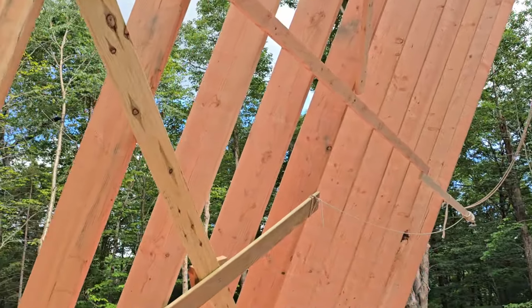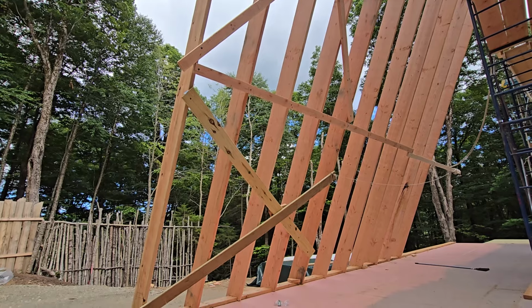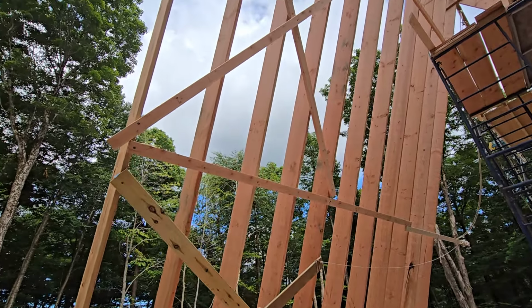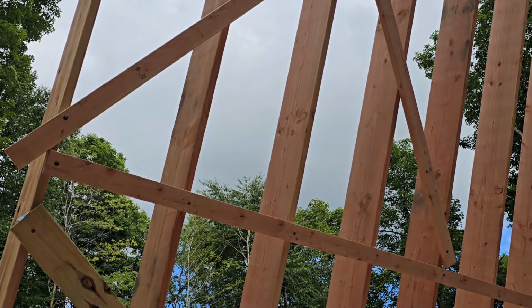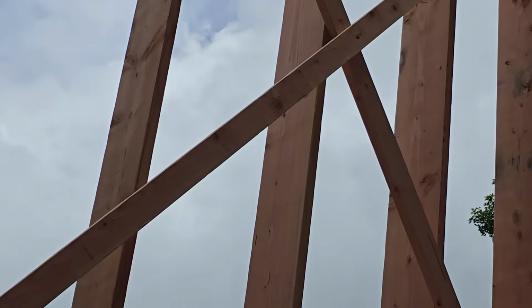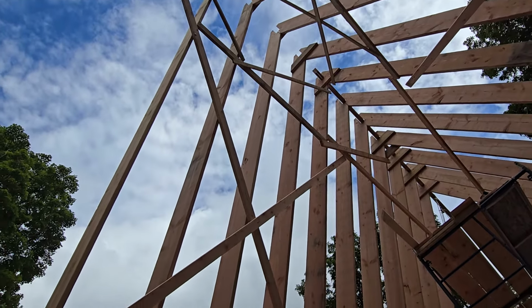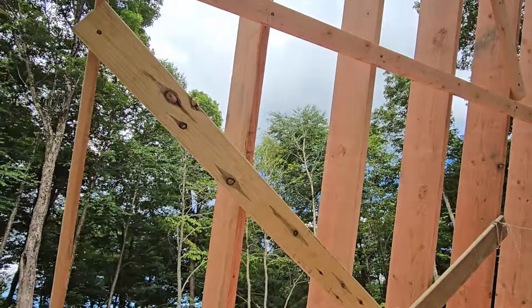So what we did is, there's 2 things that went on here. One, we grabbed wood and we braced, so these X's create triangulation so that nothing can move. And then what you see above that, these are layout boards, and you can see, lighting's a little squirrely here, but we got a lot of X bracing. You can see X bracing at the low level, at the high level, and then up higher there's various braces there.